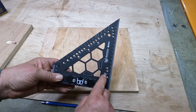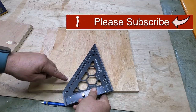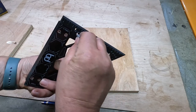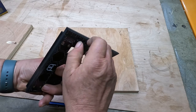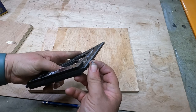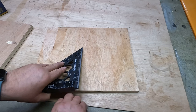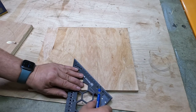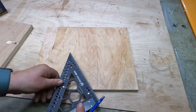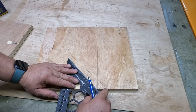It also has a pivot point. So instead of putting it on the edge and pivoting by eye, we put one of these pins in the pivot point, take the other pin out and put it into the 45-degree mark. Now we can actually go all the way down to the edge and get it right to the corner — so we can do 45 degrees all the way to the edge of the work.